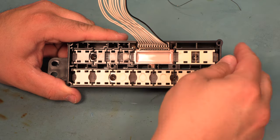We're going to go ahead and put the solenoid board back into the plastic housing. We're going to slide the board under the black plastic tabs here at the rear. We're going to install the 2 screws that hold that solenoid board in place. Okay, next we'll hook up the electrical connector for the solenoid board, and we'll reinstall the vacuum lines. Let's go ahead and put the back back in place. And we'll use some electrical tape.